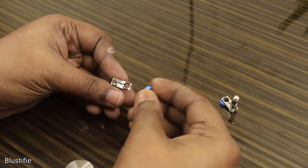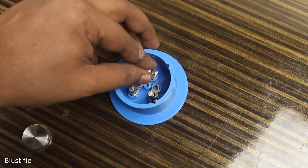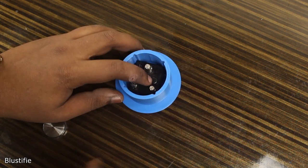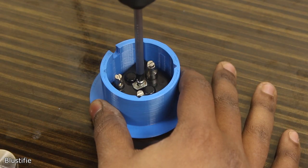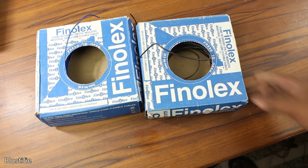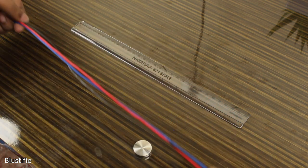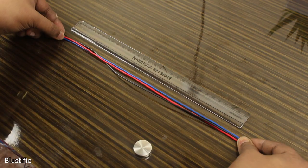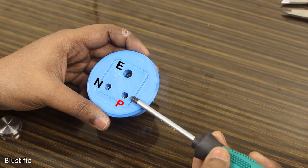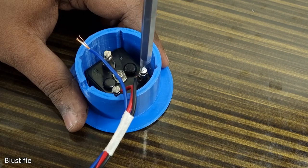Now it's time for assembling. First, I used a bit of two-component adhesive on the spacers and inserted them on top of the unnecessary holes. Next I placed the pins on the respective cutouts and put the back cover in place. I left a screw hole in the design, so I placed a screw and tightened it — not too tight, not too loose. I then prepared the extension wires: 0.5mm² red, black and blue, respectively for Phase, Neutral and Earth — 1.5 metres of each. After stripping them, I hooked them up accordingly. The right side from the front is Phase, so from the back the left side is Phase, the right side is Neutral, and the thick one is Earth.